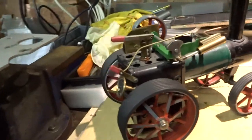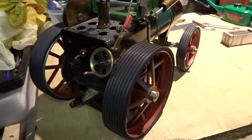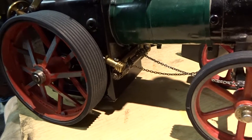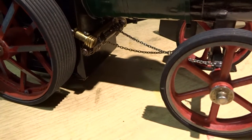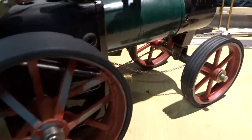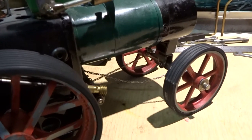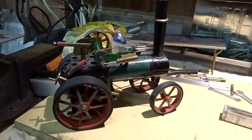I also, like the roller, made a steering wheel. This one's made out of brass — I turned it up on the lathe. Again like the roller, I turned up a worm on the lathe with a pinion I had from somewhere, and made some steering chains — well, it's a jewellery chain really, a bit too light — and attached them to the front axle so that you can actually turn the wheel and steer the thing. Just pointing those out before I take the wheel off and show the gearing.